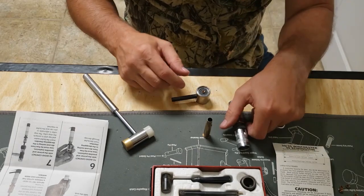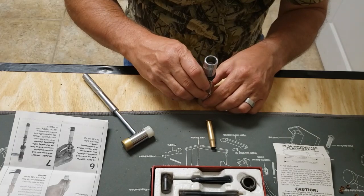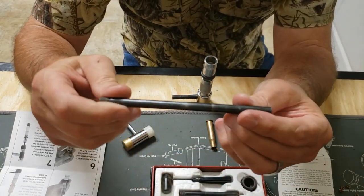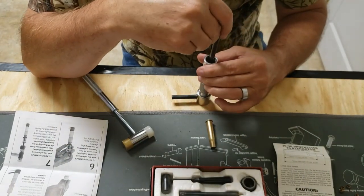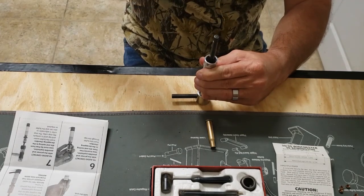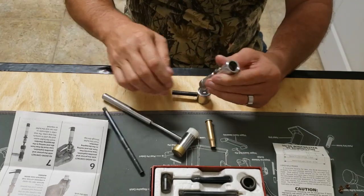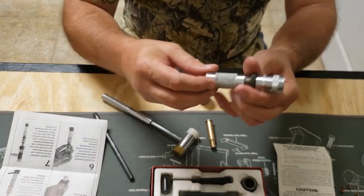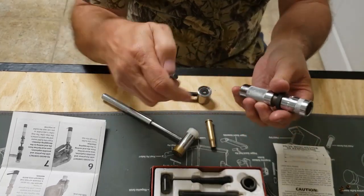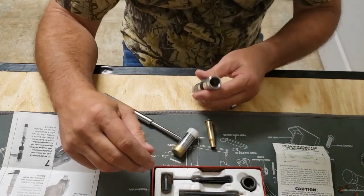You place the primer right there. Okay. And you set this right on top of here, it looks like. It sits right just fine. And then you need your priming rod, which is this tool here. Okay, and you drop this into here. All right, then you tap that down to seat your primer. It actually changes tone when you hit it. We know it's fully seated. So there you go, fully seated. Okay. Now it's supposed to knock it out, which it did. Now the shell's pretty much knocked out. Okay, so that's good. So I'm done with that now. Done with this now.